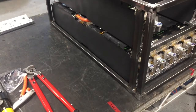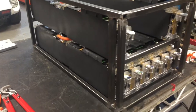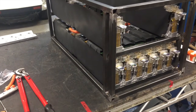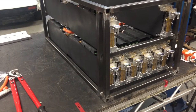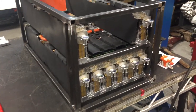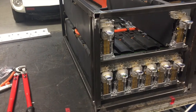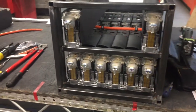Unfortunately I cannot show you the vehicle test fit because it's a bit secretive. Once we do the test fit in the vehicle we can do the brackets on the side to work out how we bolt it to the vehicle, before I do the final build and clad all the outside. I think I'm going to do 1.2mm sheet steel — because the box section is quite thick we can drill and tap it, so it'll be really nice. I'll paint the frame and then screw and seal the sheet to it, which at least gives access in future if we need to get into any parts of the system.